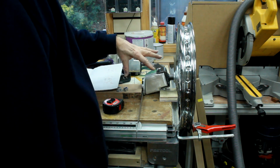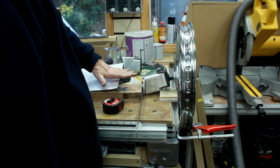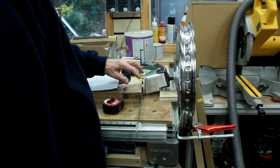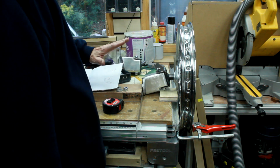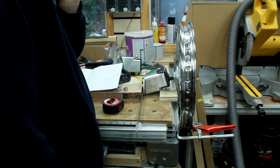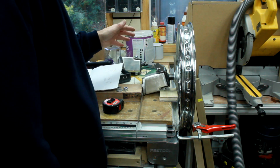So this will enable me now to go away and mock up the front axle on a stand with these collars, the metal plates already drilled, so that the welder can just literally come along and weld what I've set up for him, so there's no problem about him having to worry about geometry or anything like that. So you can do that.